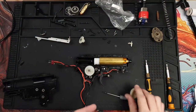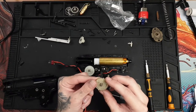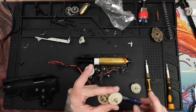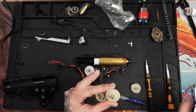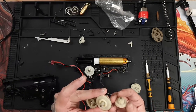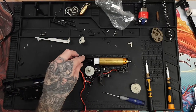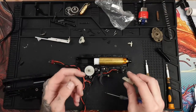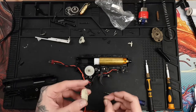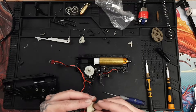So that may have been the problem with the original gear then, because it's not short-stroked. And there's no visible damage on any of these other gears that I can see, which is kind of the problem with nylon gears sometimes. So it may have been binding up. If I recall correctly, it was screeching like crazy when I last used it, locked up. I thought the bevel and pinion, something on there had gone. She was screeching around the other way.